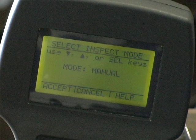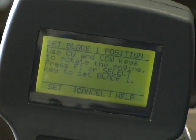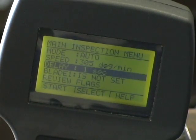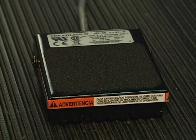The DTT's automatic and manual modes put the user in full control during operation. Automatic mode will begin the inspection after the operator determines blade one and continue through a complete rotation of the engine. It can also be adjusted to pause at each blade. The included foot control provides for hands-free operation.